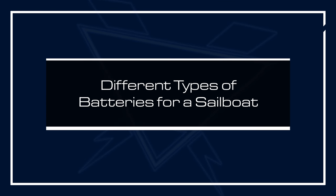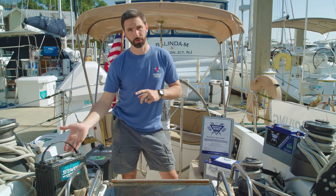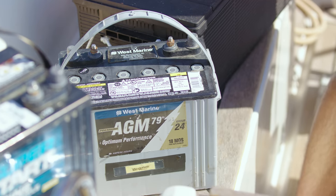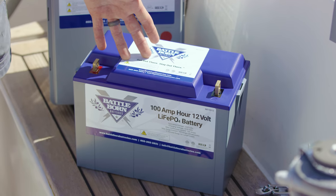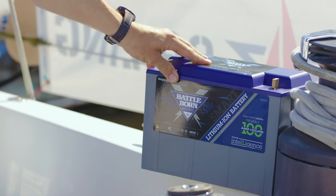Okay, let's get started. So what are the common types of batteries used on sailboats? On my right are lead acid batteries. These have been used for decades. There are different varieties: flooded lead acid, AGM, and gel batteries. They all have very similar charge and discharge characteristics. On my left is the newer technology, Lithium Iron Phosphate. These batteries are made by Battle Born and are built with a similar form factor to their lead acid counterparts. Here are two 8D batteries, and over here is a new battery featuring wireless communication.